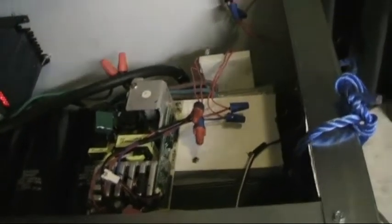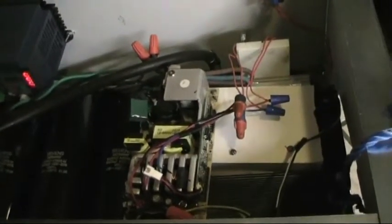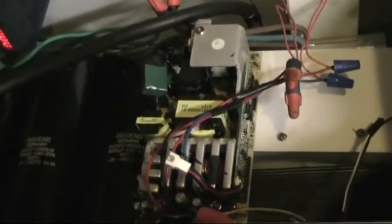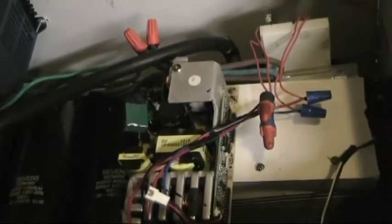Which is pretty reasonable for driving an IGBT gate. The interesting thing about this is what the computer power supply can do for it, and it's easy to use this computer power supply in a DC system. Just in case you're wondering how to get the AC to power that — inside these power supplies there's a rectifier which actually converts the incoming AC into DC anyway.